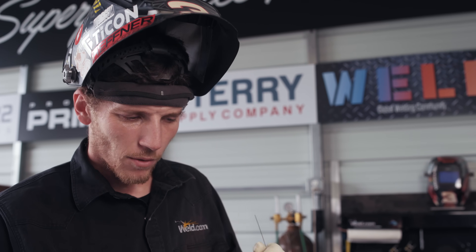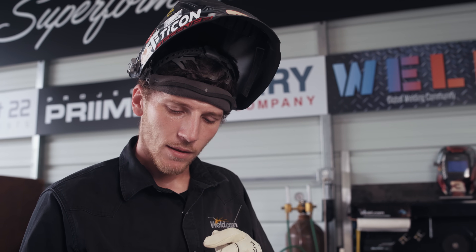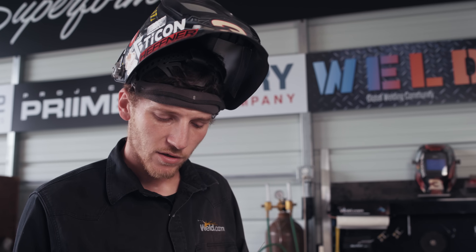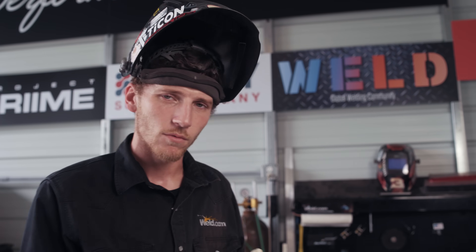This requires almost pedaling the heat because you've got to keep that heat down, but you want to keep the lower heat-affected zone within the shielding gas. I'm going to attempt to run about a two-to-three-inch bead here and have the whole thing come out silver — which is what we want — without using a trail cup.